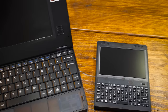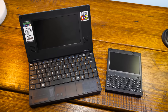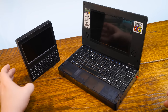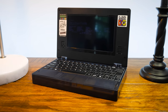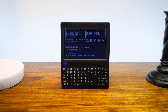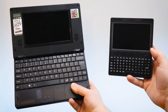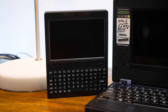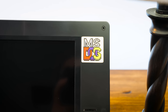While they're not emulation boxes — you won't find a Raspberry Pi or a lone FPGA controlling everything inside — these are DOS PCs running an 8088 and 386SX processor respectively. Each system uses legacy chips on custom PCBs inside, melded with various open source projects, off-the-shelf components, and injection-molded enclosures. In other words, the Book 8088 and Hand 386 combine just about every homebrew project in the enthusiast retrocomputing hobby over the past several years, smushed into attractive little palm-top/handheld cases. Well, somewhat attractive.